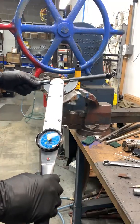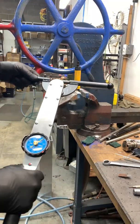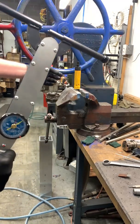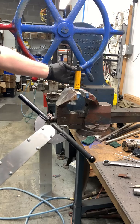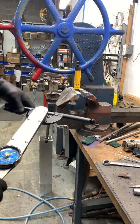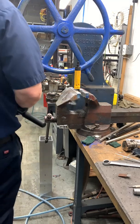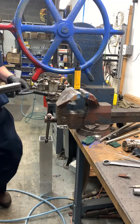Okay. Make sure you have a properly calibrated torque wrench connected to the mandrel, and torque this top collet nut to the proper specifications that are in Surveyed. Surveyed is telling me 25 Newton meters.